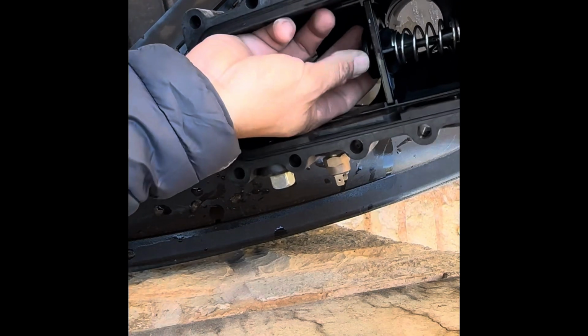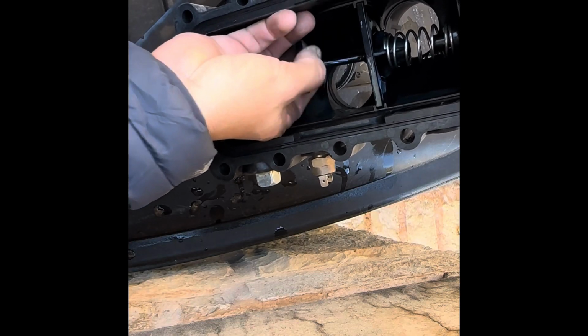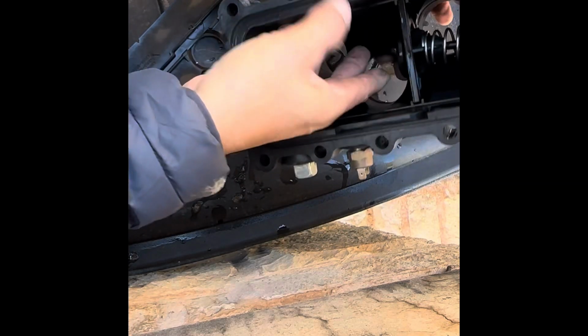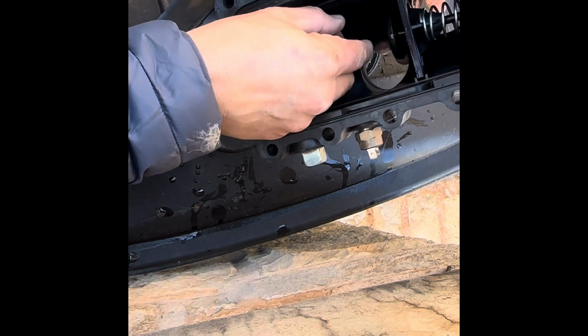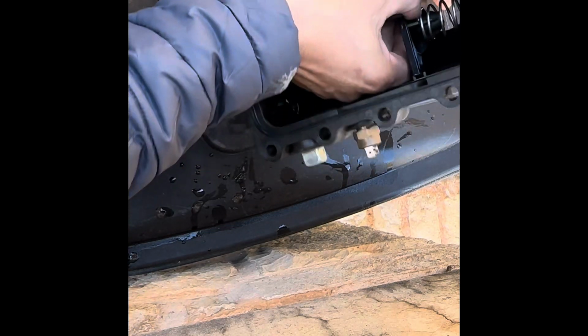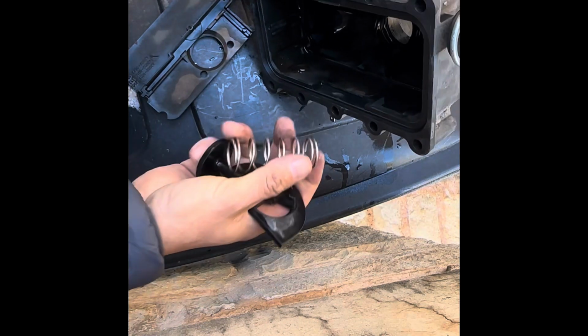All right, and as you see, there's the broken valve. It's not supposed to just come out like that. It's a bypass valve right here. The water comes in the top of the heater, and as it gets warm, this thing opens up and allows water to go through here and back into the pool. Otherwise, this just slides right out. There it goes. Broke. Okay, and we got that out of there.